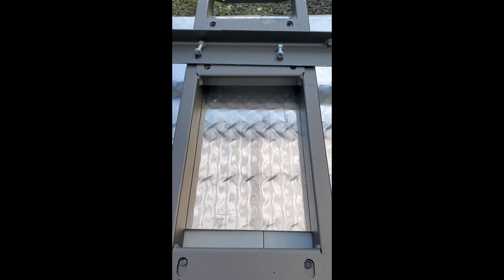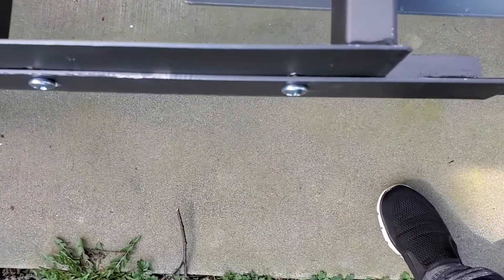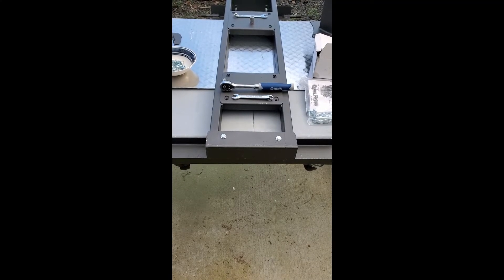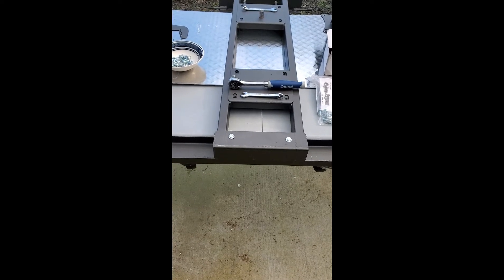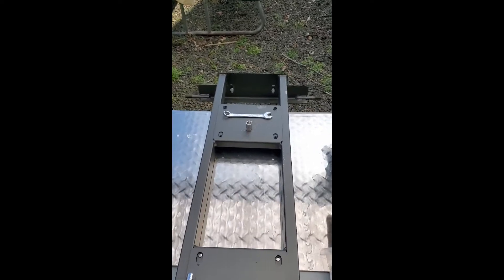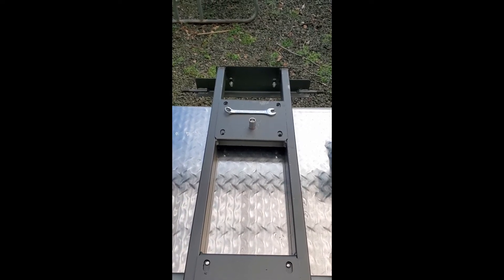Here's what it looks like put together. Here it is with the rear axle in place — I've put the two 5/16 by half inch screws in with the nuts, just hand tightened, same as the picture. Now we'll do the caster side. The four inch bolts with the nuts are just hand tightened. You'll need a 7/16 wrench, open end wrench, and socket set to tighten this properly. Also the rear side is half inch — you're going to need a Phillips screwdriver and an open end half inch socket as well. We're going to go ahead and tighten these and get them on.